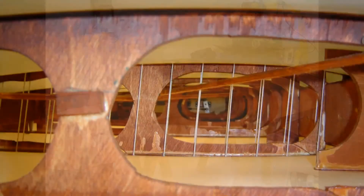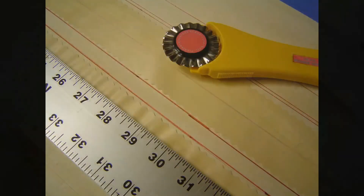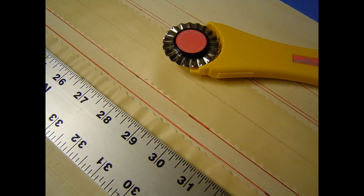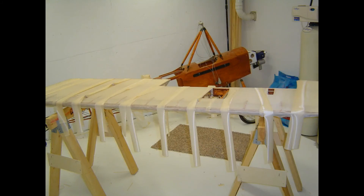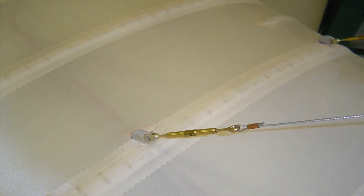Looking through the wing you can see how the thread looks. A couple people have said that's not how they do it — they sew with a big curved needle — but each wing is different. I've seen it done both ways, and a nice gentleman actually sent me a 1928 document on how to sew fabric on wings, and this is one way to do it. I tested the pinking at first but didn't like the way it looked, so I got a proper pinking tool to put nice little edges on it, pre-pinked everything, and applied it to the wing.